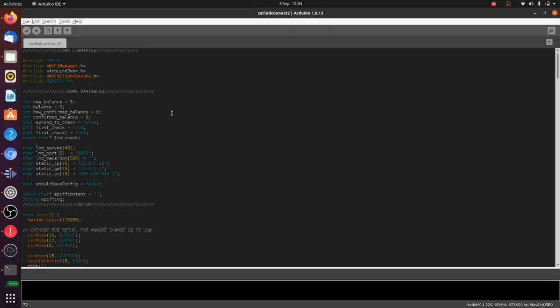Once you've opened up the project in the Arduino IDE, you'll need to have the ESP32 boards installed. You can get instructions for that on the GitHub — there'll be instructions for installing the Arduino IDE and the ESP32 boards into it. That gives you access to WiFiManager and WiFiClientSecure, because that library is packaged with the ESP32 boards. You also get SPIFFS filesystem included on that as well.